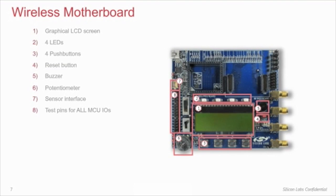The test pins include NIRQ, SDN, NSEL, SDI, SDO, SCLOCK, and GPIO 0–3, and they are accessible via a 10-pin connector. Other than this connector, the GPIOs are all accessible via the four SMA connectors.